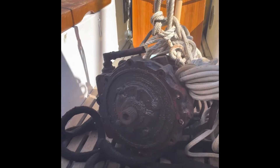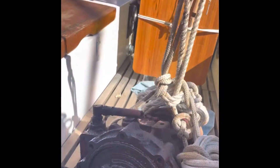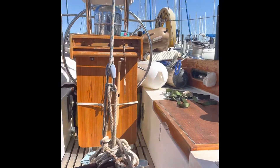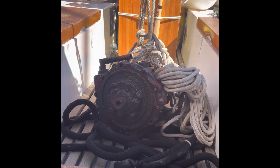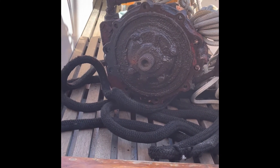Fully out! Got her attached to the halyard so we can get her on shore. The final pull I used to get it out: I put a block right here and ran a line, which gave me an additional angle at the companionway, and then I had the angle through below down to the rear winches from both sides. With those four points, I was able to play the lines and get the angles right to get the transmission back and forth and up and out. Mission accomplished — we'll see how this baby will rebuild.